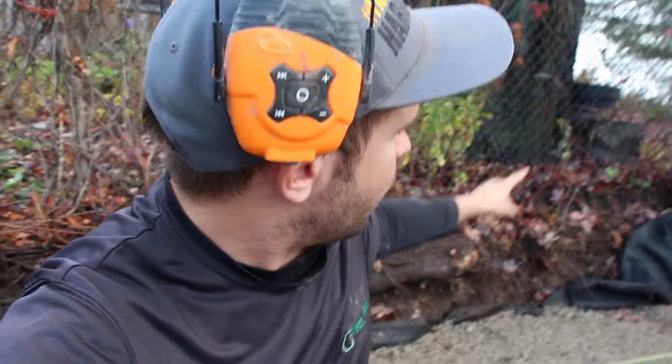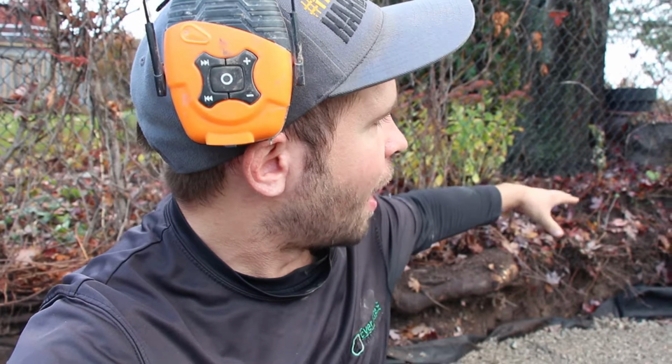So this actual return of this retaining wall that comes along the side fence is actually a change order. It's something that we had to do because of the elevation difference between the coping and where the bottom of the fence is, because that fence sits a little bit higher until we get about 6 feet out. Then it just means that we need to bridge that gap somehow.